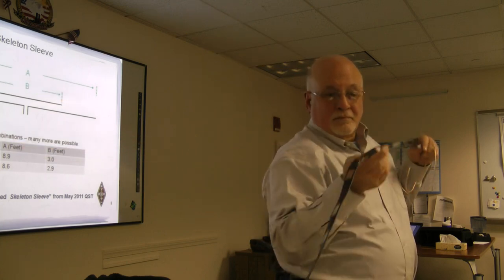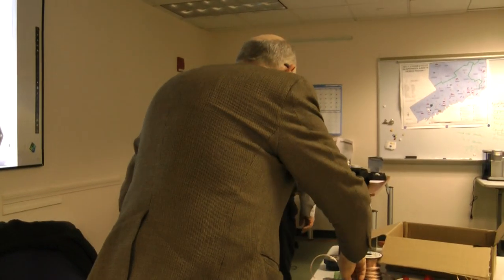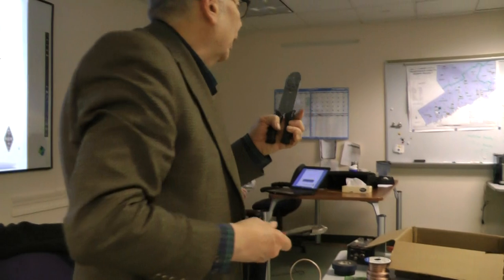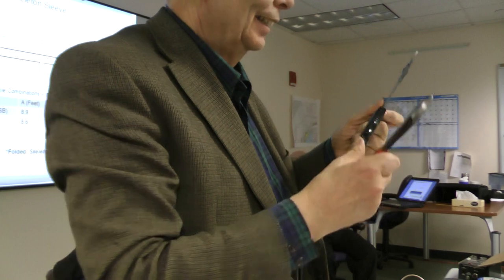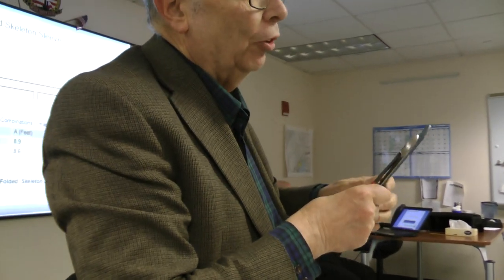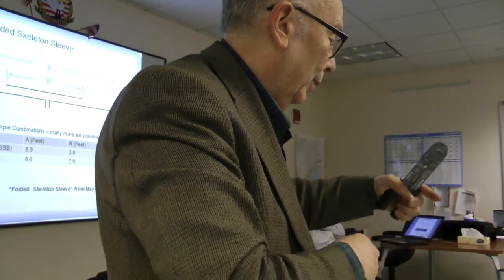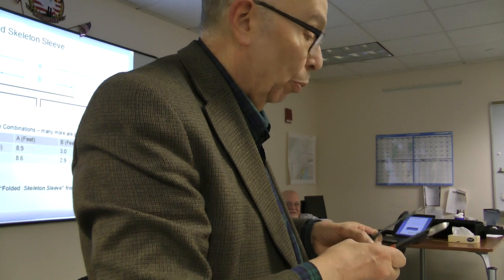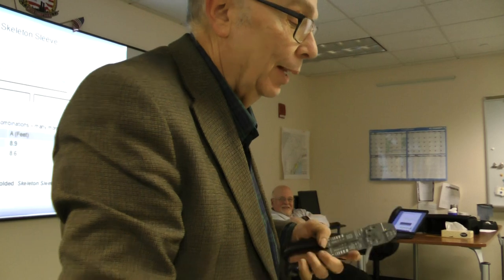There's a couple of comments I want to make about crimping, and that is crimping tools. You can get things like this at Radio Shack, if you can find a Radio Shack, or you used to be able to. Well, also hardware stores and whatnot. And these you get in a kit that's not all that expensive. There's only one problem, and that is that they're kind of crappy in performance. If you even crimped by pushing down on your desk and whatnot, things fell apart. John can tell you.